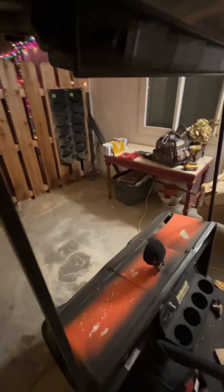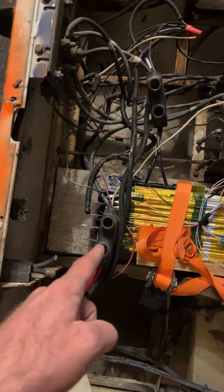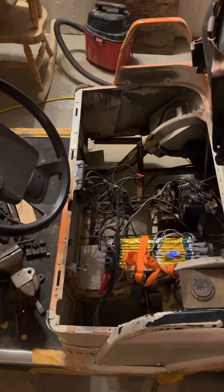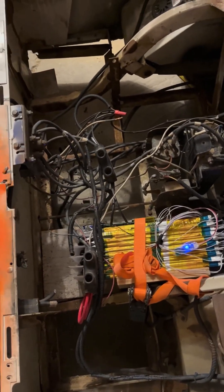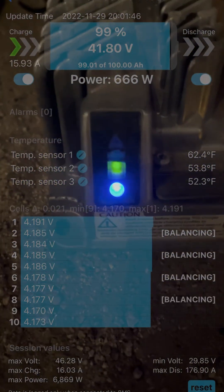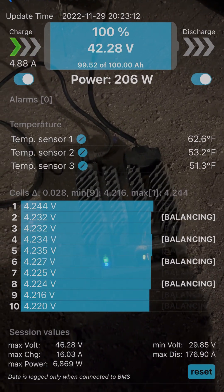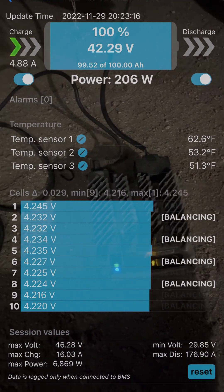Here's the golf cart we're putting the battery into. We got it in with big lug connectors — you can use the aluminum version that aren't encased, you can buy those at Lowe's. We crimp the terminals and stick the wires in there. We got the big wire in there and then a bunch of small wires for the negative side wire-nutted together for now. We'll drive this around and test out this battery, and then we'll probably try to permanently fix the battery in a little better later on and get it painted. Any 36-volt battery charger should work on a 10S lithium, and near the end of charge the charger intentionally tapers the amperage down to about 4 amps as it gets close to full.